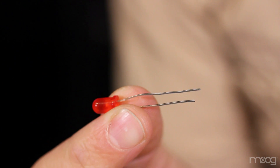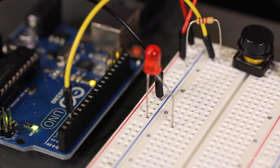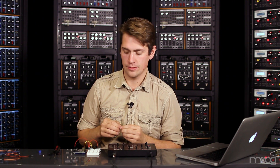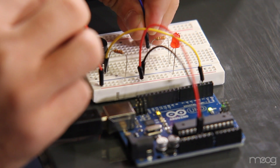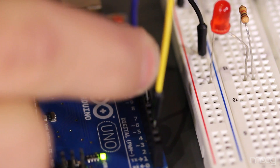Next, we'll need to plug in our LED to our Arduino. An LED is a polarized component, so there is a positive and a negative. The positive lead of the LED is the longer one. So first, we'll need to plug in the shorter lead of the LED to ground. From the longer lead of the LED, run a 1K resistor. Next, we'll need to run a signal line into our LED from our Arduino. Run a jumper cable from the 1K resistor connected to the positive end of our LED into digital pin 6.